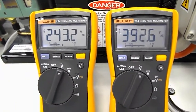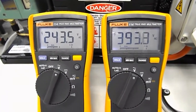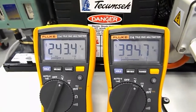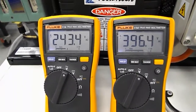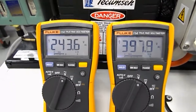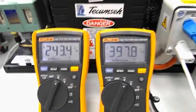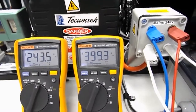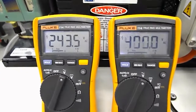So the relay has to be designed to deal with a very high back voltage in order to operate. You don't normally get to see this because unless you put a meter inside the relay box at the associated locations you won't see it, but I've set this unit up for you to interface the connections across the potential relay and demonstrate the voltage which is being produced.